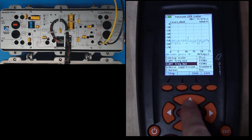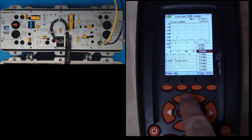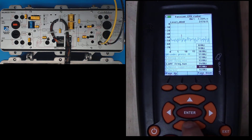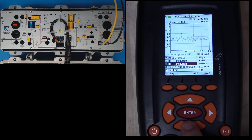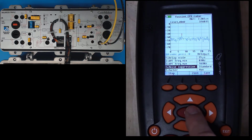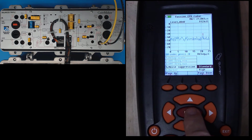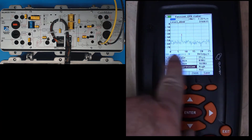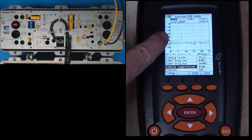I still don't see any CPD. That tells me it's not caused by signals that are very close to 12 megahertz — this is just broadband noise. So I'm going to return my band pass filter to 8 megahertz on the low side and 16 megahertz on the high side, and I'm going to use the noise suppression feature. Select high, and now it is making several sweep passes, starting to isolate the noise. You can see CPD is starting to emerge.